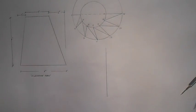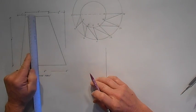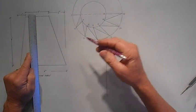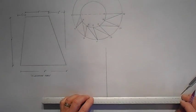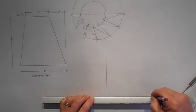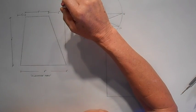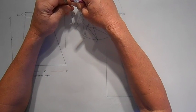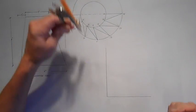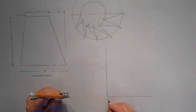I'm starting out by drawing this particular transition piece pattern. It's going to be 6 inches tall, so I draw a line 6 inches down here. Now, at a right angle to this, I'm going to project a line out here. Remember, we're looking straight down and out. The bottom of that right triangle would be this length from point 8 to point 1. I take my compass and go right to there, and write out here 8-1.